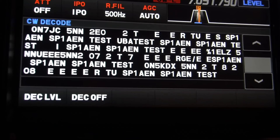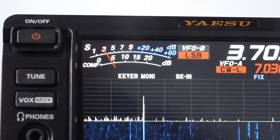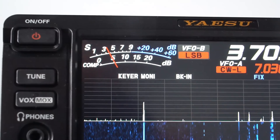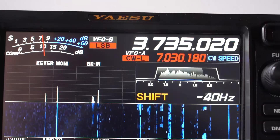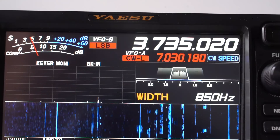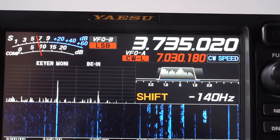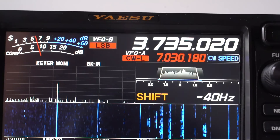The FT-DX10 will decode CW and makes a pretty good job of it, as you can see. The FT-DX10 meter is simulated analog, whilst the ICOM uses a bar metering system. I found the selectivity on the FT-DX10 extremely good — the variable selectivity goes from wide down to extremely narrow. I'm quite impressed with that. The band is fairly quiet still; the skip has started and there's a little activity.